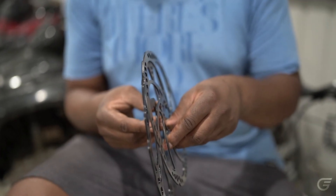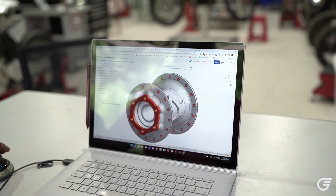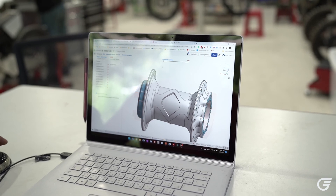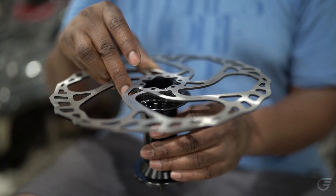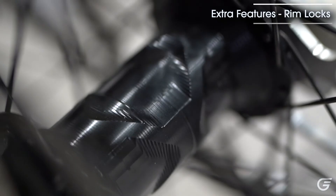This is really a good fit for our electric motorcycles, which are a little heavier than a mountain bike but still quite a bit lighter than a full motorcycle. This is the Graft rear hub — our pin-drive hub. We manufacture our own hubs in-house. What we've done with this hub is create what's called a zero-dish wheel, where the spokes are symmetric, compared to most motorcycle and bicycle wheels where spokes are asymmetric. This gives us more strength and a lighter weight. The pin-drive interface for our sprocket ensures we can transfer the tremendous torque our motors generate. Our torque-shell design transfers torque across the hub, applying it equally at the left and right side through the spokes.